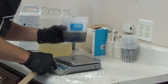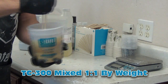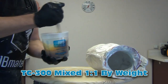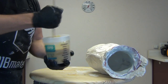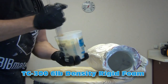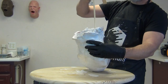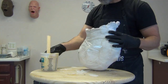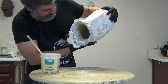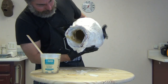This is one of those processes you want to be careful about when using a really soft mold, because this is a soft, stretchy silicone mold. Especially if you're using TC5110F — a soft, stretchy one-piece silicone mold — when it comes time to cast foam into it, you need to be very careful not to overload the mold and cause distortion. So I'm using TC300 in the six-pound density, mixed just enough to slosh around and coat the inside of the head — not trying to fill it up entirely.